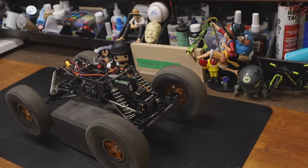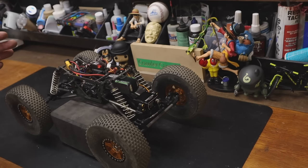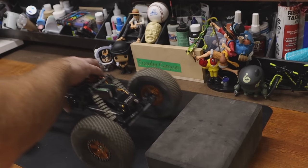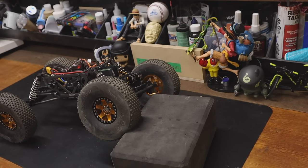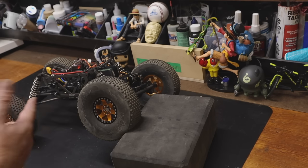So, as you can see the wheels coast down? This has drag brake turned completely off. Because when unloaded, they will roll. But if there's any load on the worm drives at all, it's drag brake. It's not an electronic anchor, it's a mechanical anchor. It can't rotate unless the motor rotates it. So I thought, oh my God, it's drag brake.